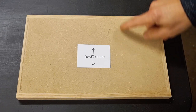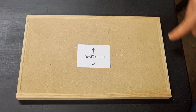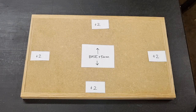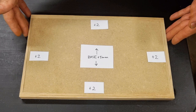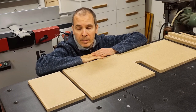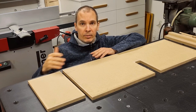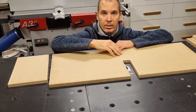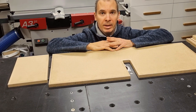A few hints on dimensions for method two. In the length direction, make the base around 5 millimeters oversized to have margin for the initial trims where you cut both long sides and cut into the base. Add about 2 millimeters on each edge banding thickness as well for the final trim in both directions. Method two with these extra margins may seem complicated, but it's a really fast method once you've done it a few times. The remaining things to complete this part — gluing on the laminate around the corners and putting the profile on the edges — became too long for this video, so that will be in part 2b.